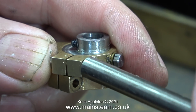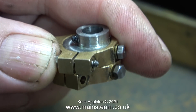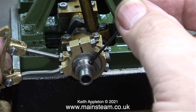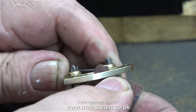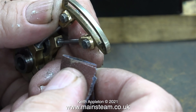When I looked through the plastic box full of fittings, there were two eccentric strap pinch bolts missing, so I assume you need to take these from the original eccentric strap, which is what I'm doing here. In this clip I've turned the engine around and I'm doing exactly the same to the expansion link at the other side. In this clip I'm setting the starting point for timing the engine — more about that in another episode. I went on to clean up the expansion link, so now both of them are nice and shiny and smooth.